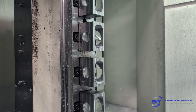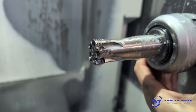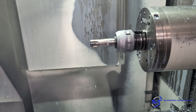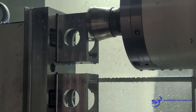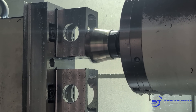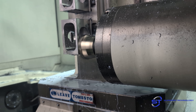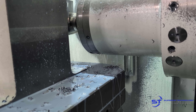This is a quick look at what the parts look like after the feed mill has roughed them out, and the tool inside of the milling chuck. Standard 20-thou finish cut. This is the same face mill that does the 90 and 270 degree faces, just to hold that two-thou run-out so there's no taper. You'll see in the next video that I actually lead off on a radius to not have a mark.